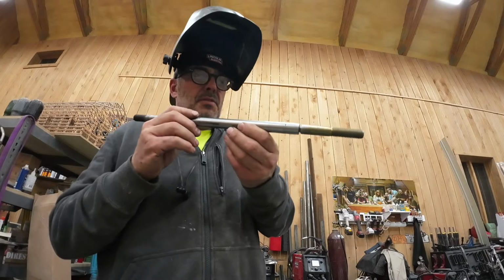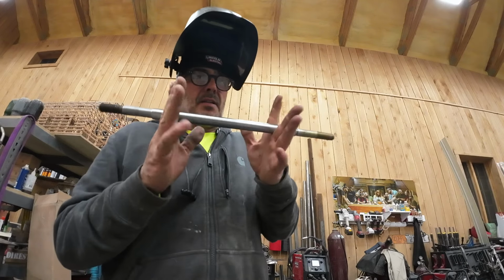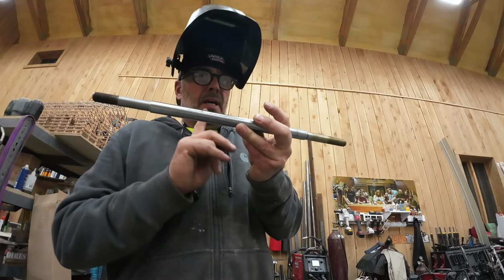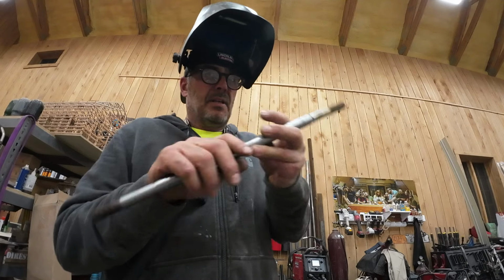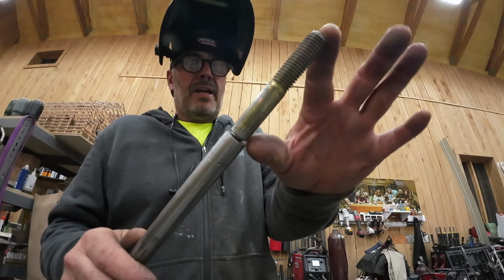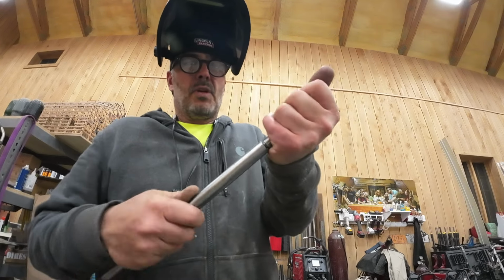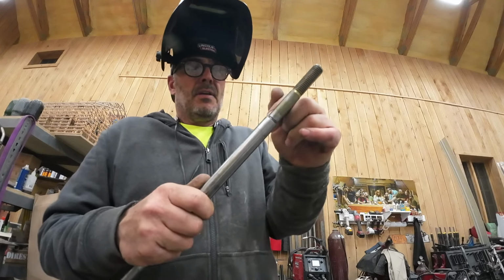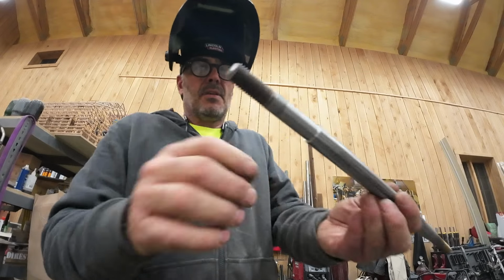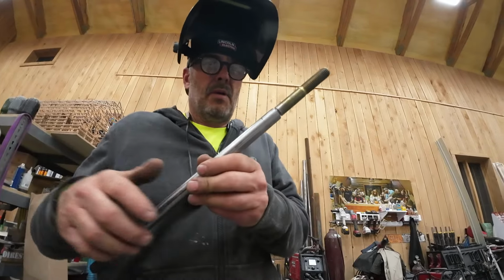They won't become unscrewed. This is a hardened steel shaft, and it's going to run through the pillow blocks at each side of the frame. But we're going to cut it in half. One side had the reverse thread for the buffing wheel originally, and the other side didn't have anything. But we got a grade 8 bolt. The boys pinned it in there, and we could pull this back out, but it's banged in. Now we're going to TIG weld that, and then we're going to chamfer a shoulder on that, so it's going to match this exactly the opposite. Stand by and watch.